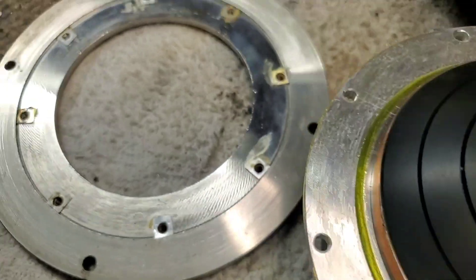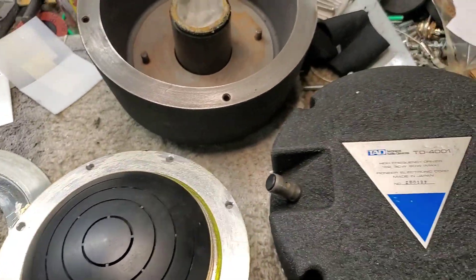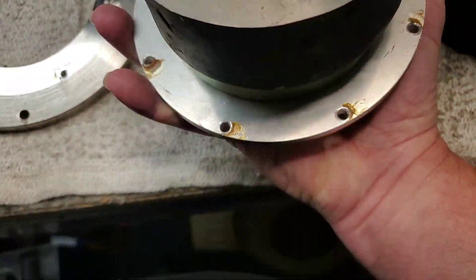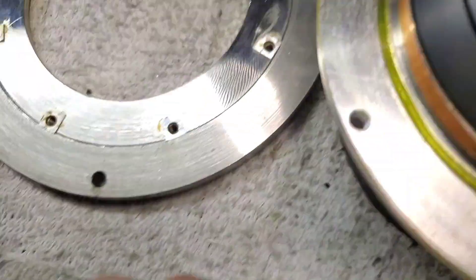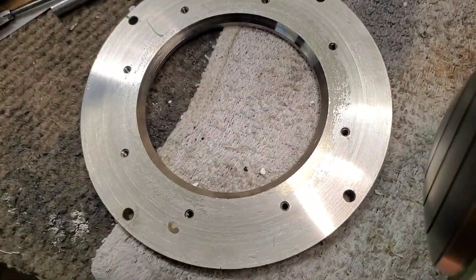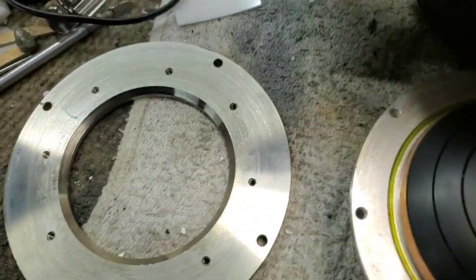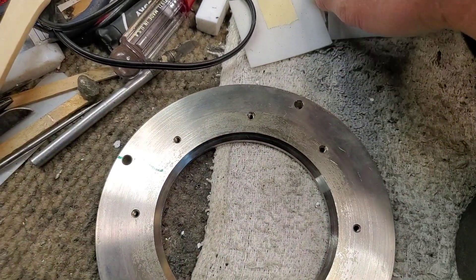One issue was the gap was misaligned, so I had to discharge the magnets. You can see that the magnet is totally discharged. I'll take the screws out of the top plate — these are all the screws that bolt the phase plug magnet assembly on. So all the screws have to come out. I've got to take this glue off and put some new glue on it, and then reshim it. I built up shim pieces that are 30 thousandths of an inch, because that's what the gap measured.